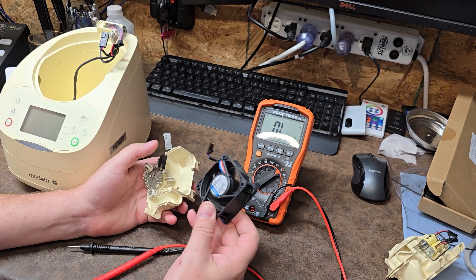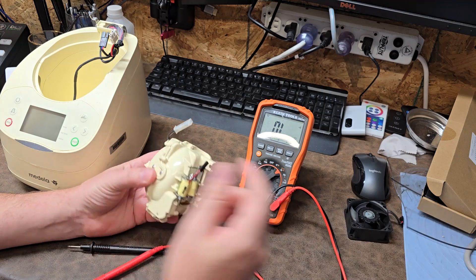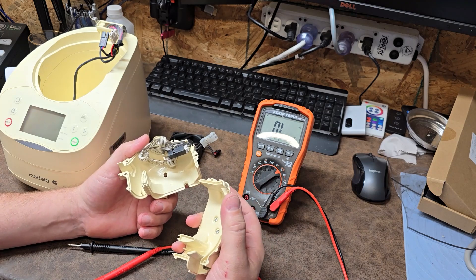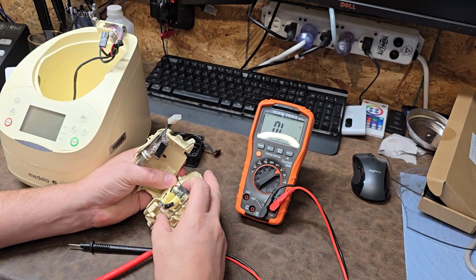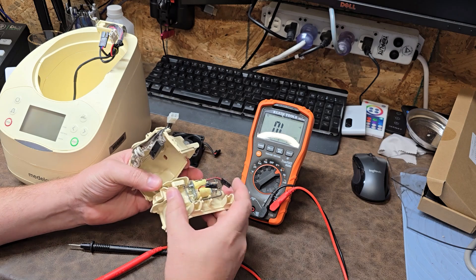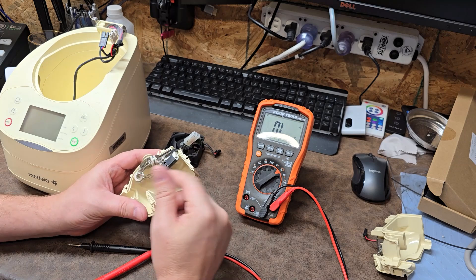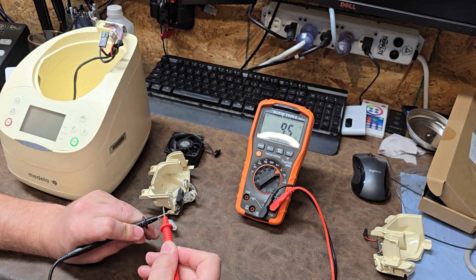You can see how I just took that apart - very neat. I love the design; they put a lot of time, energy, and money into this mold. It just clamshells apart. This side here has a solenoid - a couple of solenoids that allow it to open and close. And on this side we have the heating element. So this machine is not heating up.